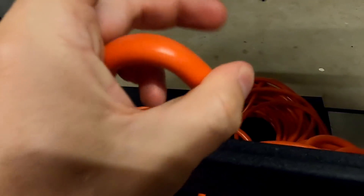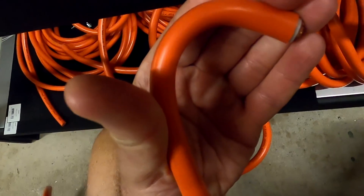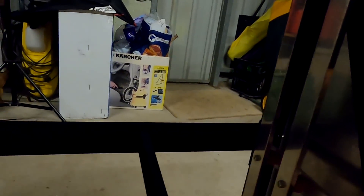I've also ordered some backward-bent cable lugs for the other breakers, because I'm in a similar situation there — but those will only be 35mm cable, so they're far easier to bend. The 35mm cable bends in a small radius, no problem at all. With these bent lugs I don't need to worry about which direction the cable goes, since it goes directly into the battery compartment and connects to the BMS and battery.